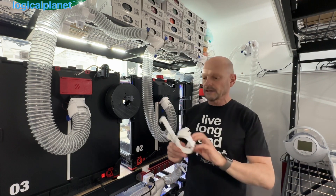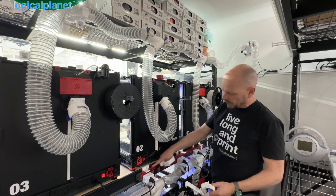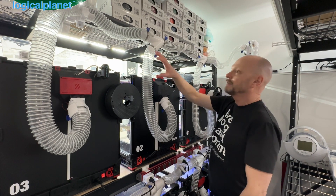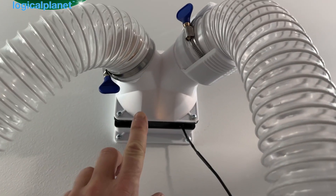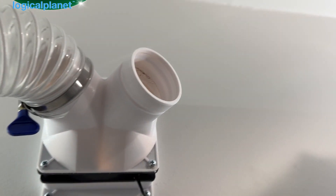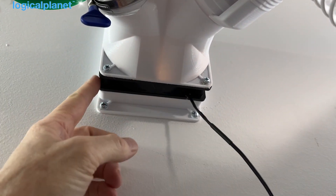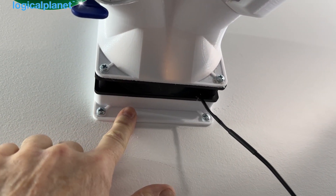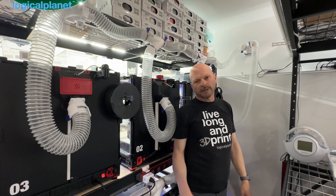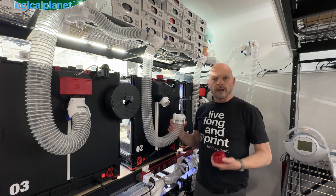I created a profile to fit onto these shelves — actually two of them, including an extended one because I've got a power bar mounted here. I needed to lower the exhaust lines. I'm running six Vorons here; they come up to the wall where there's a two-intake manifold — two lines coming in, then behind that a 120mm fan, then an adapter I made that goes from the fan to the wall and out through the wall as standard dryer vent ducting.